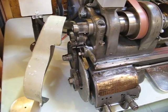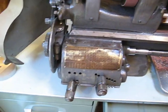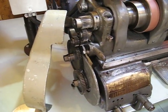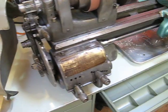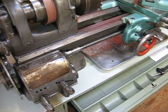In the back you find the back gears. In the case of a lathe that has a quick-change gearbox, you won't find as many gears in the back here, and there won't be as many options for rearranging them, but playing with these lets you change the speed at which the gearbox and the feed screw runs at.